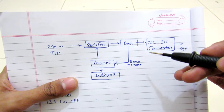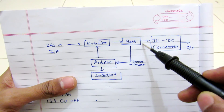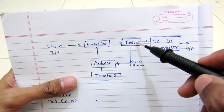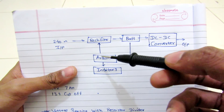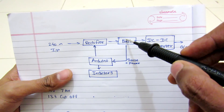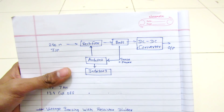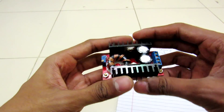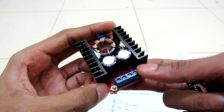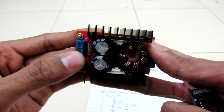There is some intelligent programming in the Arduino which detects the voltage levels and turns the relay on and off. This is also a nice DC UPS because, as you can see, we don't have direct control over the connection between the battery and the DC-to-DC boost converter. So if there is any problem in the controlling circuit, the power will still continuously convert the battery voltage into the DC output voltage you have set. At the output stage I have used this step-up boost converter from eBay.